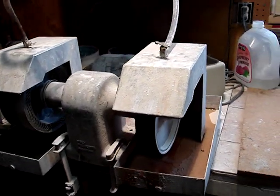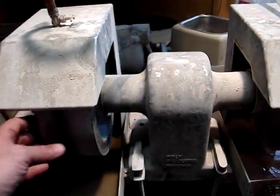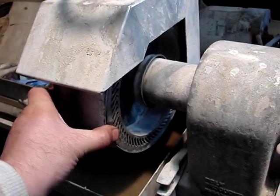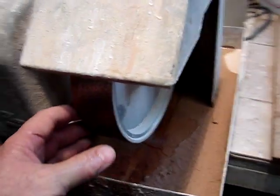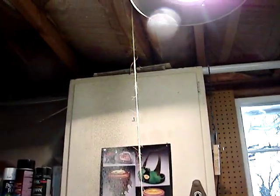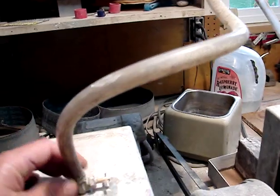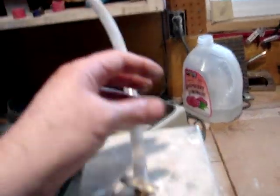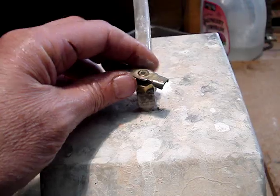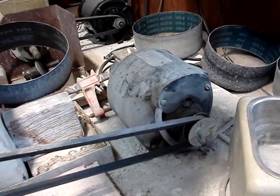Before I get started I want to show you how I got my setup here. It's just an arbor with an 8 inch expanding drum on this side and a grinding shaping wheel on this side. Here I have a 60 grit and it's just a gravity water fed. All I did was put a little bucket here and attached it to the ceiling and got some plastic hoses from Home Depot, cut them and put brass fittings on to control the water. And it's just a regular three quarter horse electric motor.